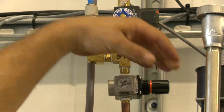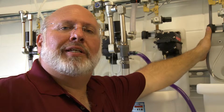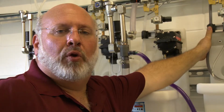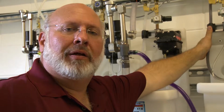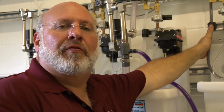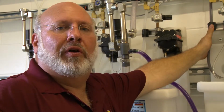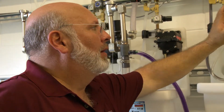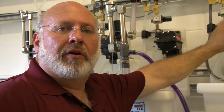All right, now we're going to talk about our CTAs. CTAs are our chemical tire applicators that are mounted on the floor in the conveyor at the very beginning of the tunnel. They are powered by, in this situation here, a G57 flow jet pump. We like the G57 flow jet pump because it's one of the easiest ones for an operator to adjust and maintain. It's very simple. It's got a hydrominder to mix chemistry. It's got a flow jet pump to deliver the product to the car.